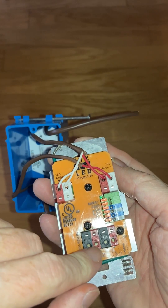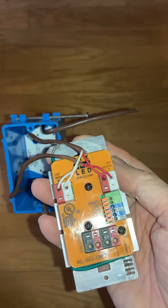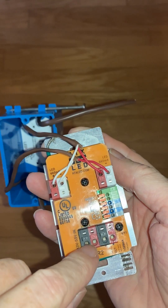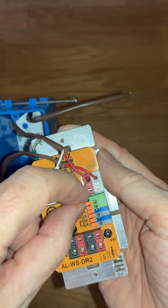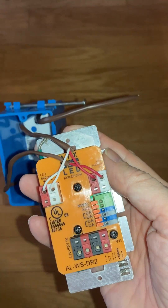This pair here is power in and power out — up and down makes no difference. We don't like wire nuts, and by having these connected as wired through the little bus, we don't have to have wire nuts in the box. This is our N-way connection for three-way switching, and these are our control lines for our automation system. We'll see you next time.